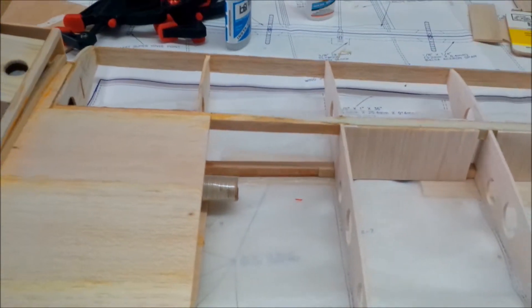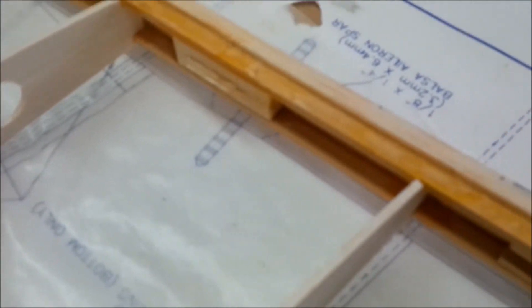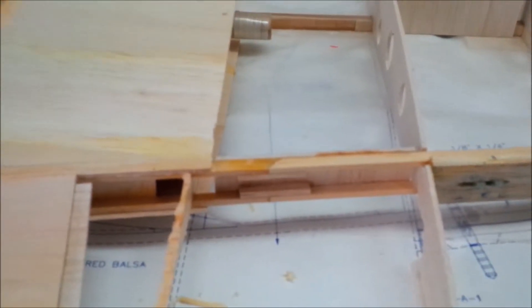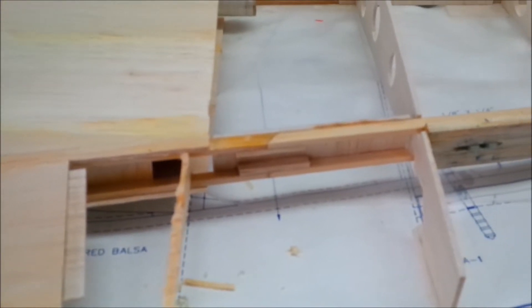So that's the main spar, and in the back there was a joint as well. This was actually broken on the inside — that's the original piece — and then there's a joint right there with a short piece joining here. Same type of scarf joint with the angled cut, which just gives a bit more gluing area.